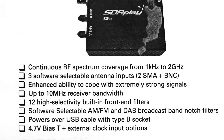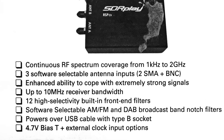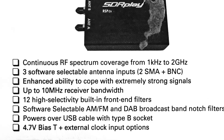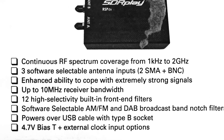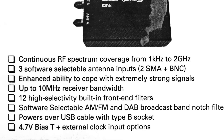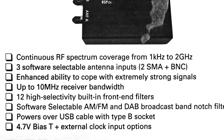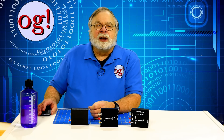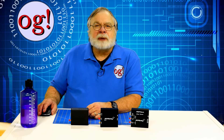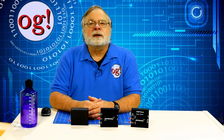What is the market for the SDR Play receivers? These are very thoroughly developed and very capable software-defined radio hardware front ends. The market includes many different people. HAMs are quite interested in these because they offer a spectacularly good spectrum and waterfall display of entire HAM bands in HF and VHF, and wide segments of bands above that well into the microwave region, as well as the ability to select specific signals to receive. You can pick a specific signal to send through a receiver that will demodulate the signal, apply filtering, apply noise reduction, and so on. Once you get used to the spectrum and waterfall display, you won't want to go back. Of course, the same features make the devices attractive to shortwave listeners.